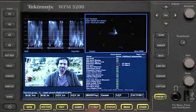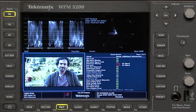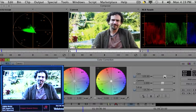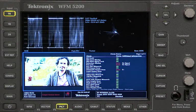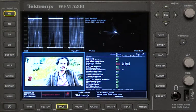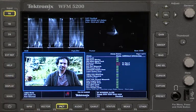The next preset is called bright up display. It looks exactly like the display I just had, but what you can't see is that in this picture monitor, if I go into color correction mode and crank up my gain, you'll start to see a crosshatch pattern in the bright areas — black stuff showing up in the bright content. Those black crosshatches are what Tektronix calls a bright up display. The bright up display shows you where specifically in the picture you're getting to be illegal. These levels showing the black crosshatch are going illegal, and I can drag this back down until all that stuff disappears, which allows me to specifically see where in the picture those illegal levels are happening.